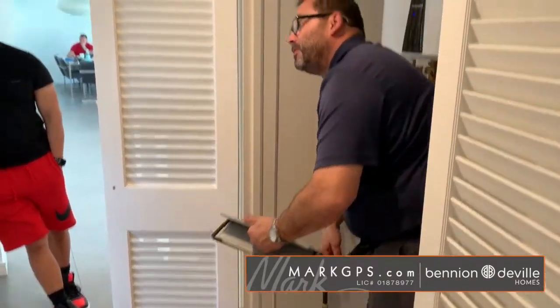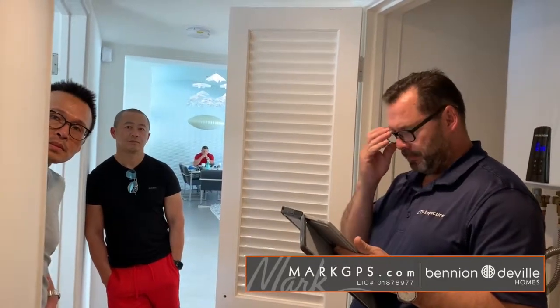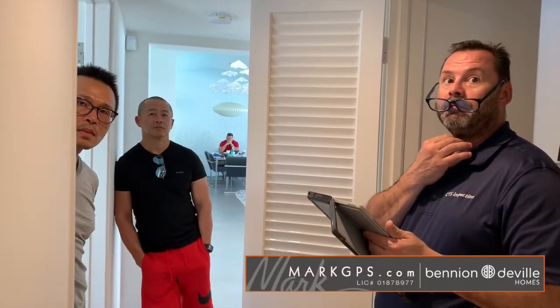The heater on the west side of the house is a 2013 model and is missing a sediment trap, which became required in the 2013 code. It doesn't mean it'll magically stop working, but it should have been installed. A plumber would add it. Sediment traps weren't required before 2013 — at some point someone had a problem, so it was added to code. The roof unit is a 2002 model, so it wasn't required to have one.